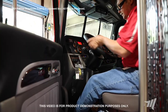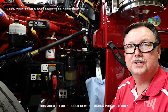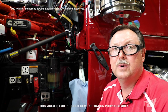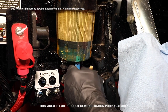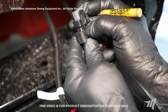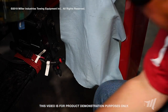One thing you may want to do to create some more workroom is to rotate this tire to the right. To begin the service process for the Stage 1 fuel filter, we'll begin by removing the OEM fuel heater connection. For this next step, you might need a pocket screwdriver. We're going to remove the water and fuel sensor connector. This connector has a primary and a secondary lock. You'll want to slide the red primary lock mechanism down to allow you to press and release the secondary lock mechanism. You may find it helpful to use a bungee cord to secure the wiring harnesses back out of the way.